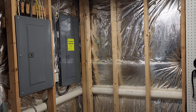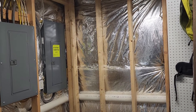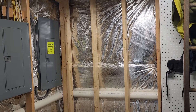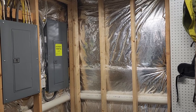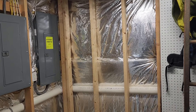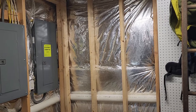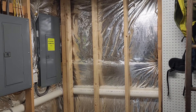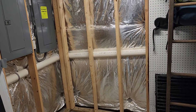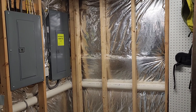Ideally I'd like a setup that would automatically kick on in the event of a power outage when we're not home. The main reason is the sump pump, but that option gets a lot more expensive — you'd have to do either a smart home panel or an inverter with pass-through UPS functionality, and all of that involves a much more complicated installation. Some of it requires permitting, so it's just a much more complicated deal.